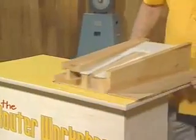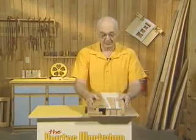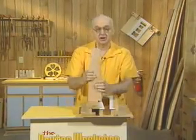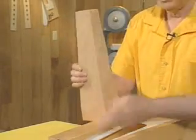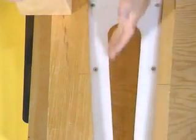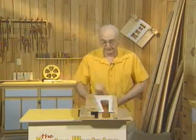I just got this. This is a real shop-made jig, folks, and the thing about it is, I've had it a long time. What it is, we've locked in here this column, and the column itself is tapered, a solid block of wood, and that's where we're going to form the teardrop, and that's the first operation. You'll also see in here where I've got this cut out exactly the same on both sides so we get this round bottom, and that's to make up the next cut, but we'll leave that for now.